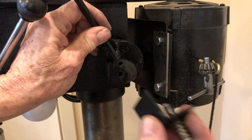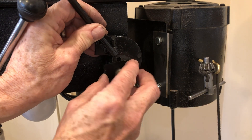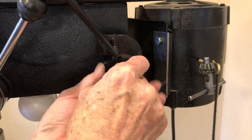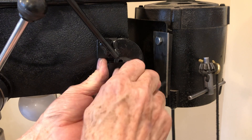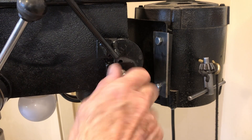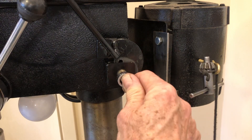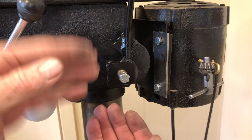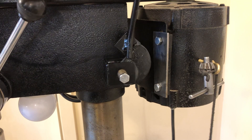Then I made this cam lever and it will sit against this flat piece of channel. And then I made this L-piece here that fits over. This screw threads into the hole that the set screw used. And then I have a spring on here so that I can add a little tension to this cam lever. I have two pieces of metal that are sandwiching this cam lever and that allows it to stay in place and not flop around.